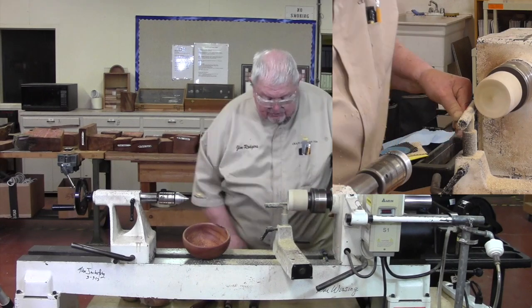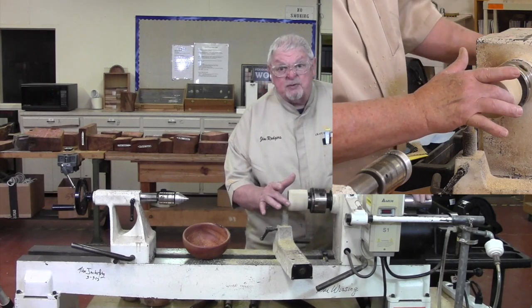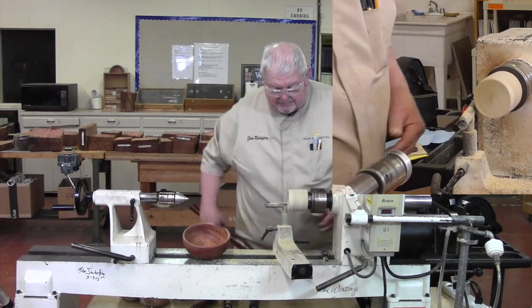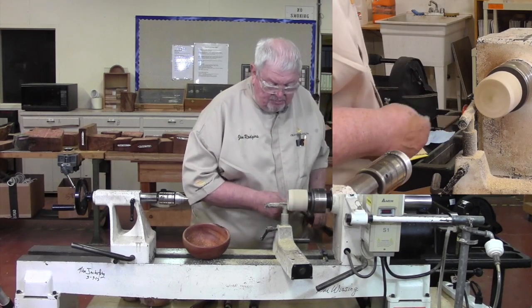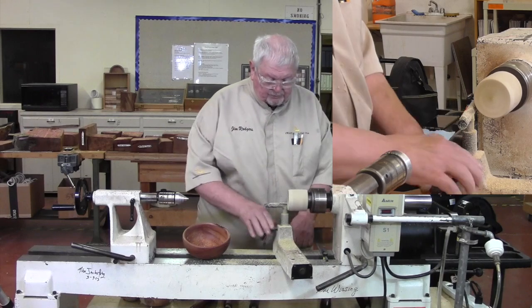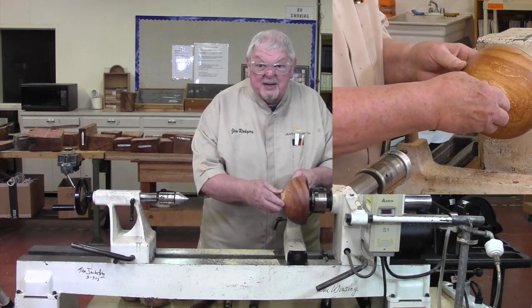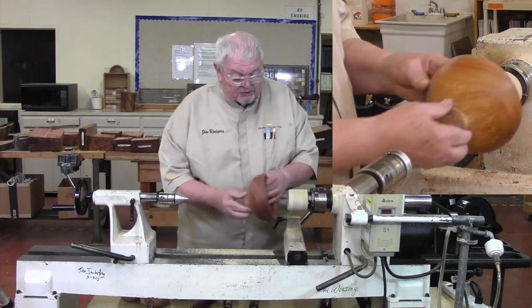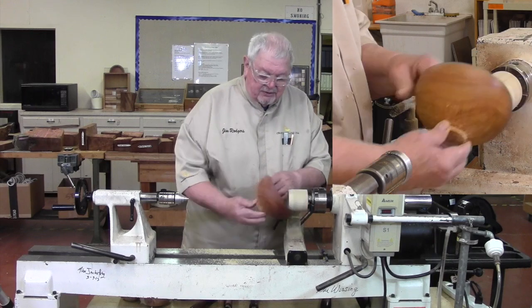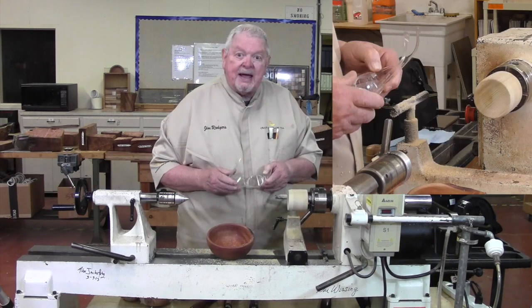And all I'm really interested in is that I have a straight, clean surface right here. That's a little sharp, I don't need it hard. So I'll break it just a little bit. So now when I mount this on here, it's going to set square to this surface. But I don't want to put it on like this because I could damage the finish in this piece. So I've got to put a pad in there of some sort.